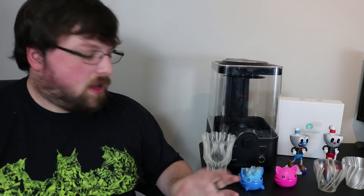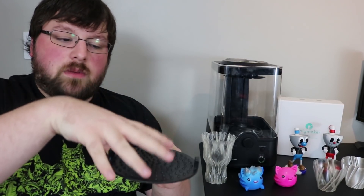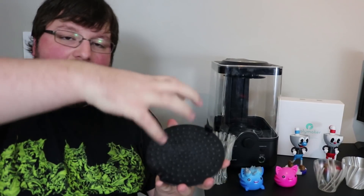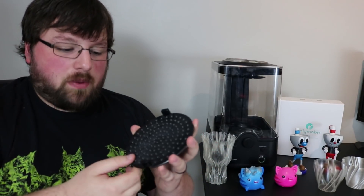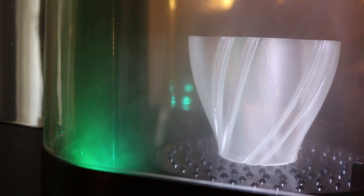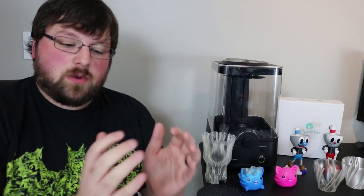Another complaint was actually the chamber size. This platform is the biggest you can do because it lowers into the chamber and there's a frame all around it that the model has to pass through. If the model is bigger than the platform, it won't go down and sit properly — we've run into this limitation a couple of times and had to angle things carefully to get it to go down. Another thing we noticed is that the alcohol doesn't seem to circulate very well. The nebulizer pushes it around a little bit, but I'd like to see maybe a fan in there to help. We found we had to take the model out and rotate it and put it back in because most of the smoothing came from above. With something close to a sphere like Kirby, the top would get smooth but the underside would still be rough, so we'd flip it over and smooth it again.